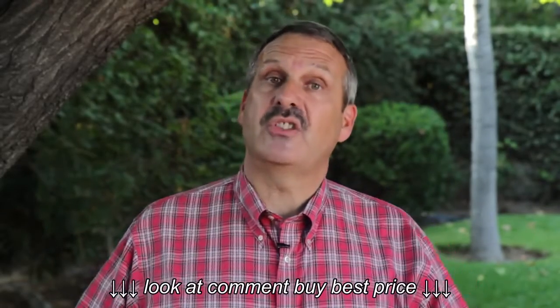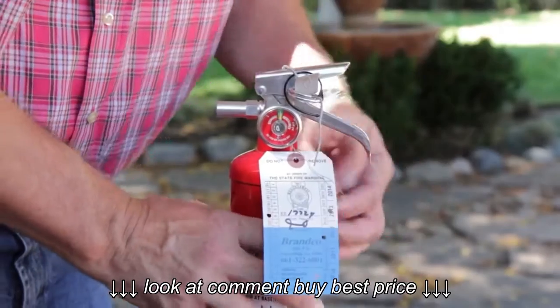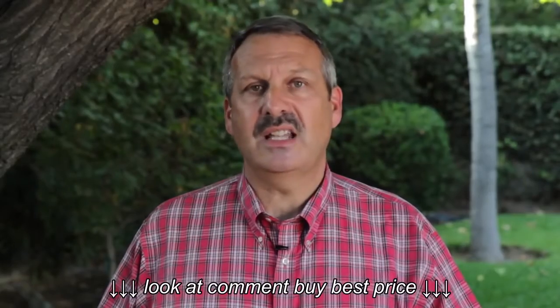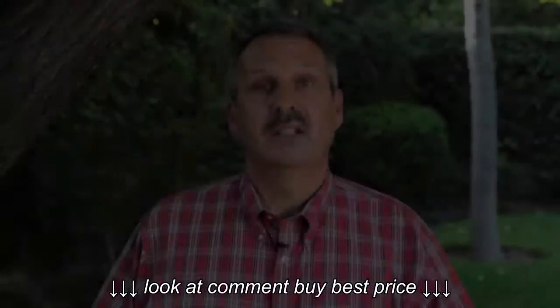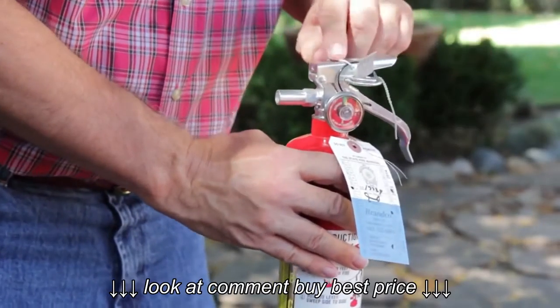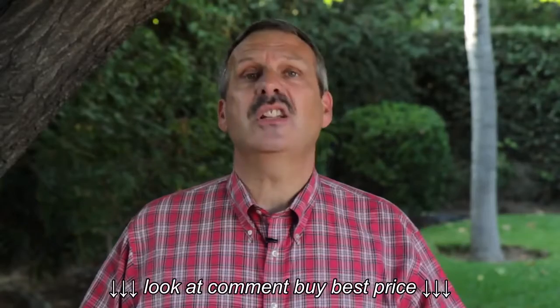Now let's inspect it. First, we need to make sure that there's a valid inspection tag that's less than a year old on the unit. Grab a hold of the unit by the handle — make sure that the handle moves freely. Take a look at the lever: does it move freely, or is it bound up in any way? Take a look at the pull pin: is it bent? Does it move around freely? Does it feel like it would come out if you tried to pull it out?